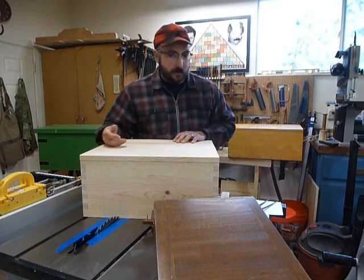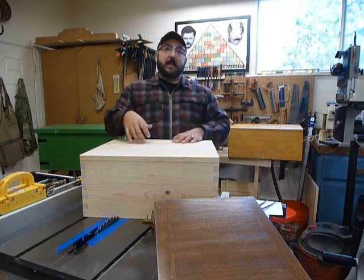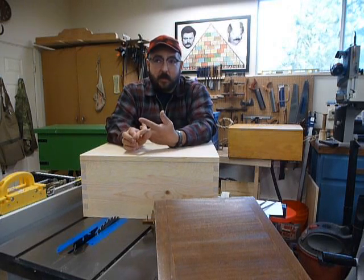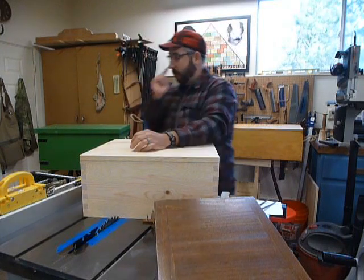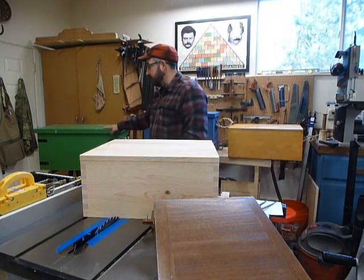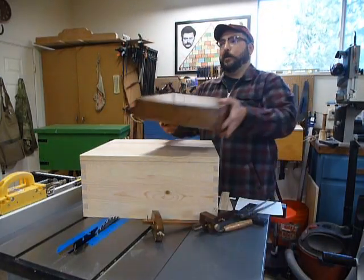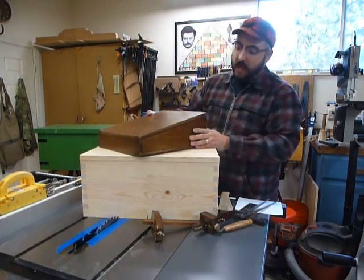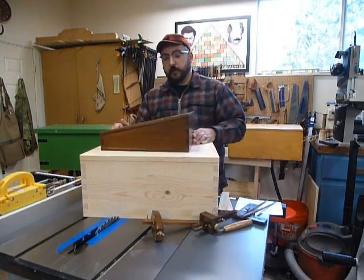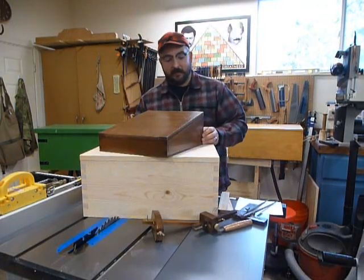There are going to be certain colors and hues you'd want to stay away from, but don't be afraid to paint your pieces. If you want quality paints, look at places like Woodcraft or Rockler — they carry milk paint finishes. This box is done in milk paint; this trunk is done in latex. You can also stain your wood. This one is just a basic stain with a shellac finish — shellac is another period-correct preservative. No polyurethane — unless it's something you have to hide. Most people wouldn't notice, but shellac works great, you can keep adding coats, and you can even get the spray version without having to mix flakes with alcohol.